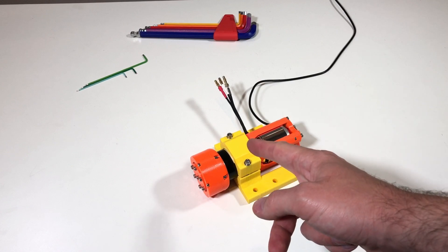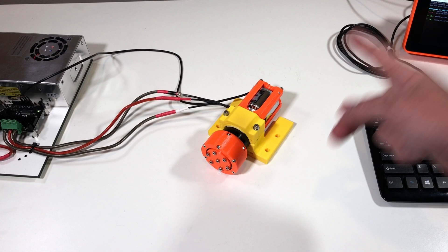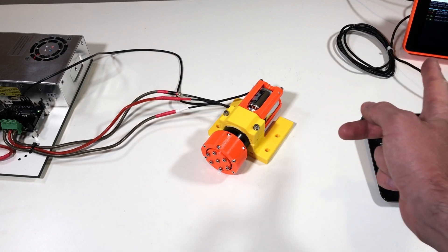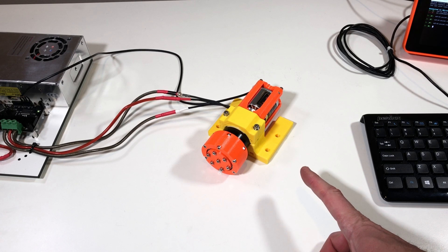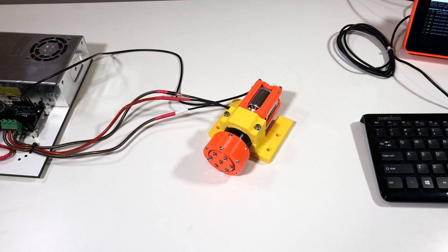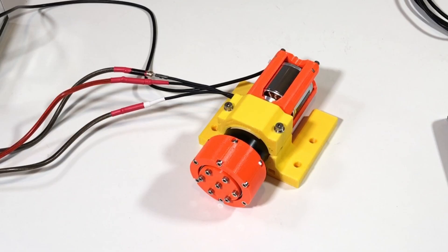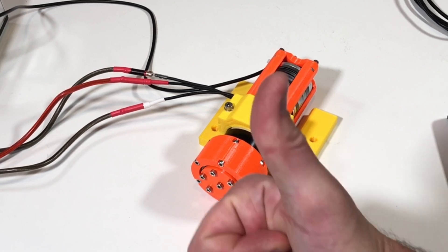And now it's time to take the O-Drive. O-Drive tool is on, motor is connected, Raspberry Pi is connected. This is a good sign. Motor rotates in one direction and into another direction. Usually this means that calibration is well done. So let's go to set point 200,000 — and this is the default speed. It does work. This is great.